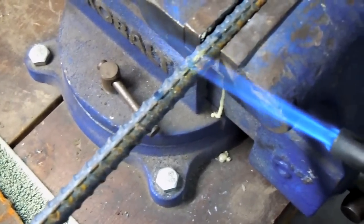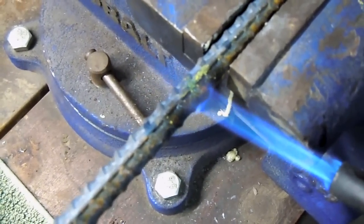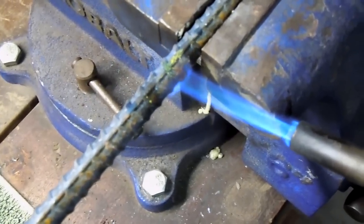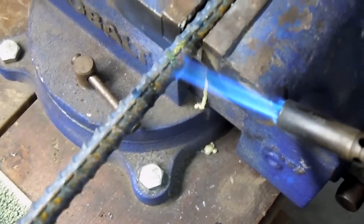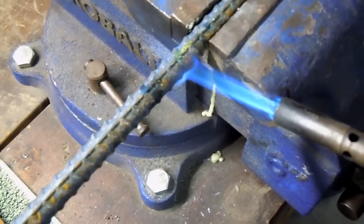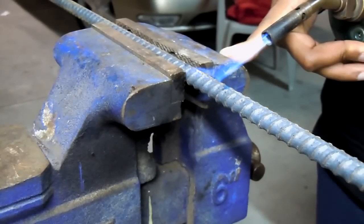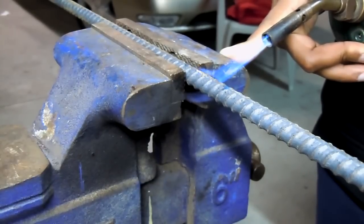So you're just going to heat it up — you'll see some condensation forming. See how it's a little wet because the steel is really cold. Once I get through that phase, it's starting to dry up. I'm going to let it heat up for maybe a few minutes and then hit it with the torch. It's been probably about two and a half to three minutes now and it looks to be pretty warm — there's not much condensation there anymore. So we're going to start with the oxygen torch now.